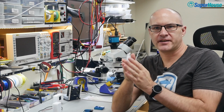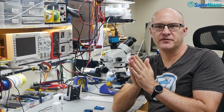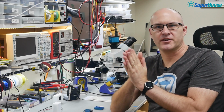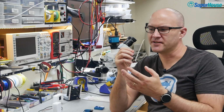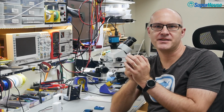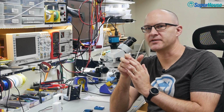When you take any material and you shave it down to being in the order of a couple of microns in thickness, it's no longer totally opaque to light. Light is going to pass through it to some extent. That means that the little particles that are floating around don't just bounce light off them, they can also act as lenses because you have internal refraction taking place within the object.